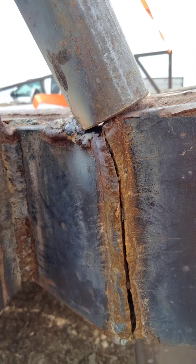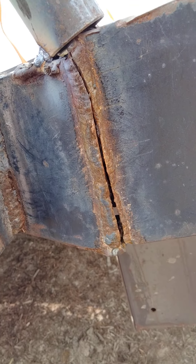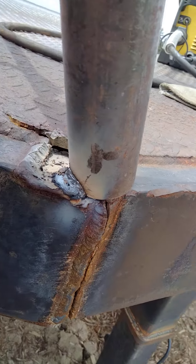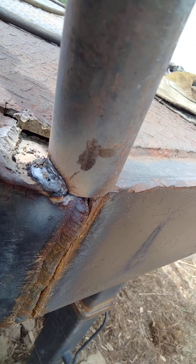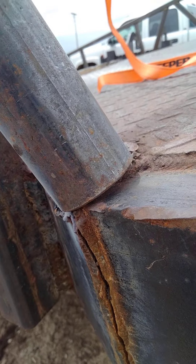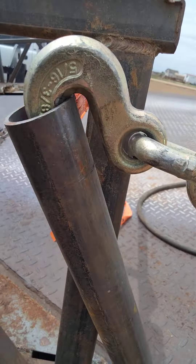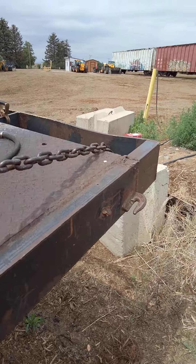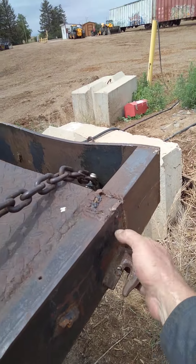This is a great trick. There's not enough weight here to pick up with the fork tines, and it's not gonna raise this side. So I got me a big cheater bar — it's welded onto the lower side, sitting on the high side — and then I hooked the chain hoist to it, so it's basically just like a big pry bar. That's why I had to regroup; this was on the outside here, not on the inside.